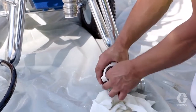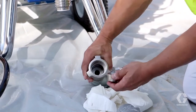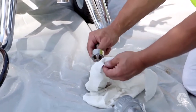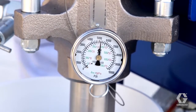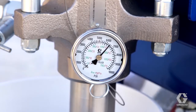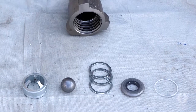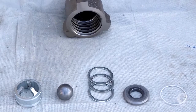Before and after each use, always open the foot valve and inspect for dried materials and other debris that may degrade performance. Clean these components with virgin mineral spirits. Adding a 10,000 psi pressure gauge at the outlet of the pump is also recommended. It's useful for correctly setting the pump pressure for maximum efficiency, as well as being a tool for monitoring pump operation and performance. Finally, keep spare parts or an entire extra lower on hand to eliminate downtime. This includes O-rings, gaskets, and other small parts.